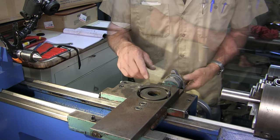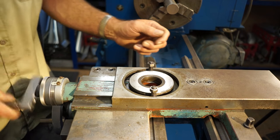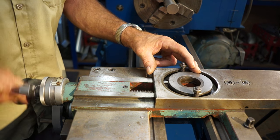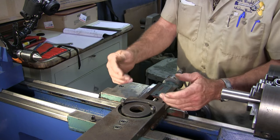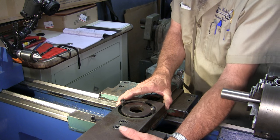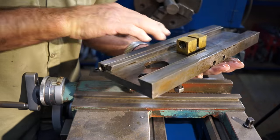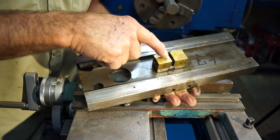The easiest way to take this off is to go ahead and unscrew it from the lead screw and it'll come all the way out to where it actually leaves the nuts. It's left the nuts but it can still slide. I'm going to come around to that side to pull it off. I can hold my hand under here. I just felt the gib — the gib lies on this side — and there's our pair of nuts.